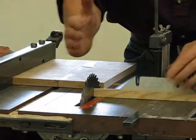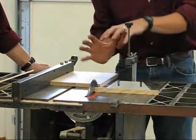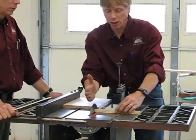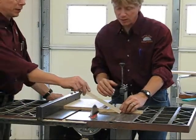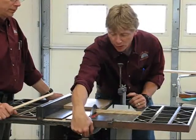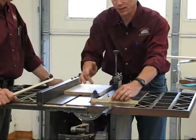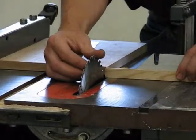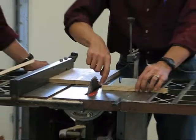Where I marked again with the tooth, I'm bringing it here. If your saw is correctly squared with your slot, it should hit that piece of wood at both points. If it doesn't, there are six bolts — three here and three here. You have to loosen up those bolts and change the whole saw unit head so that it lines up. We're looking for parallel — parallel to this edge and the blade. Once you get it close, snug one down a little bit and keep manipulating until you get exactly what you're desiring, with the tip slightly touching. Tighten down all the bolts and then test it again.